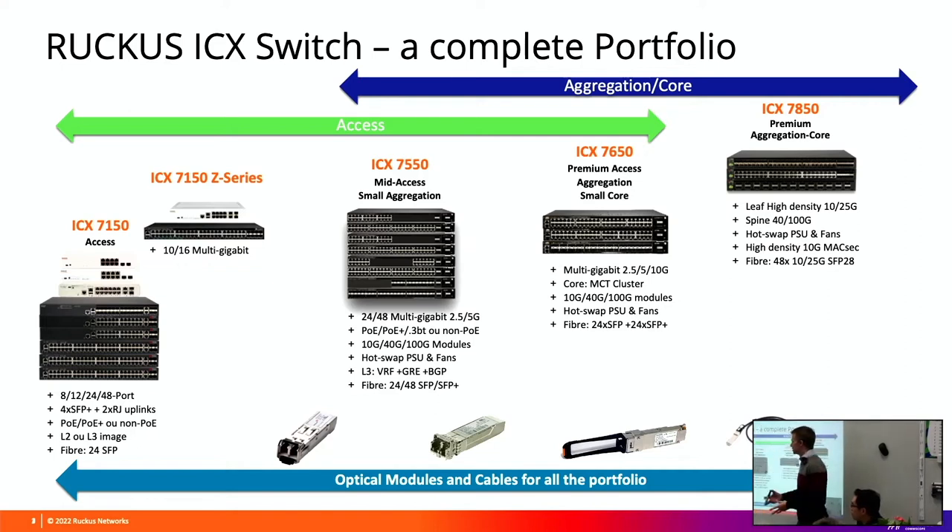The 7450 is quite a good switch in terms of cost effectiveness, and it's available at the moment - we've had some supply issues with switches and the 7450 had the most stock. The issue with the 7450 is that eight of your fibre ports - with the two rear modules - must be routed around to the back of your rack and plugged into the rear of the switch, which is not ideal but not a bad switch. That's really the only limitation it has.